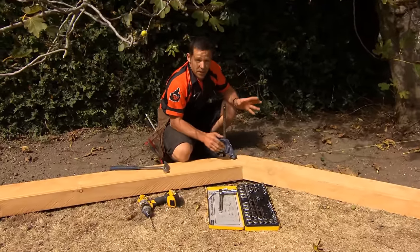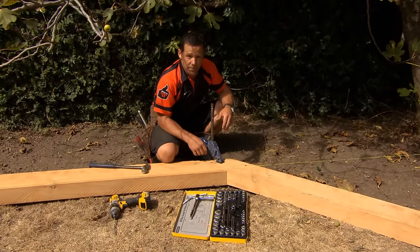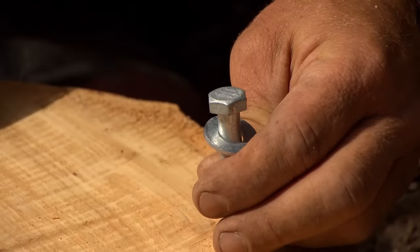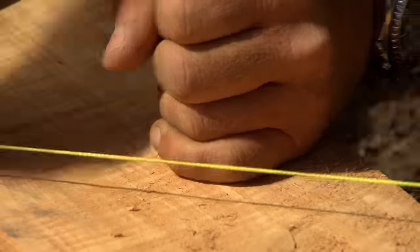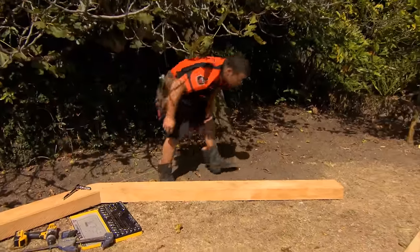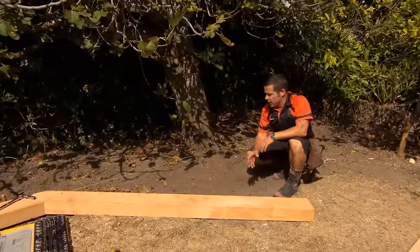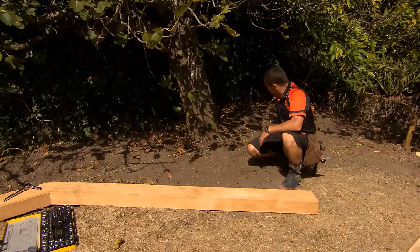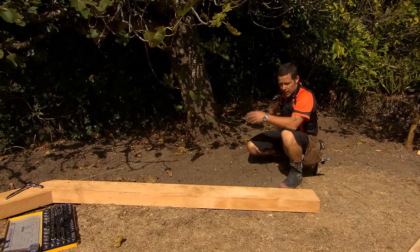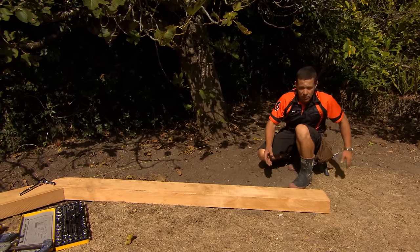The reason for our dry fit is I want to pre-cut and pre-drill everything, make sure everything is looking fantastic, ready for our next step. We've got our other corner we have to deal with here. The reason I ran my string line all the way out past our corner is because I'm going to use that to get a parallel for our other piece that's going across the front.